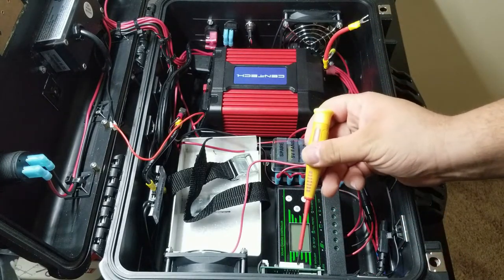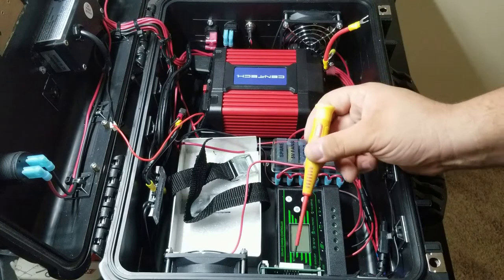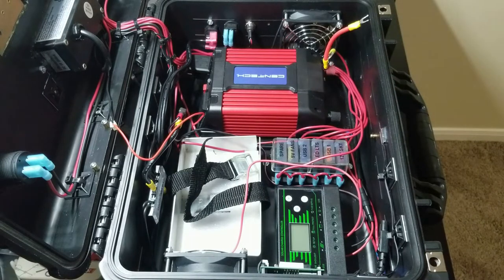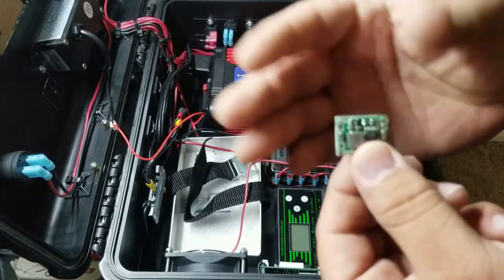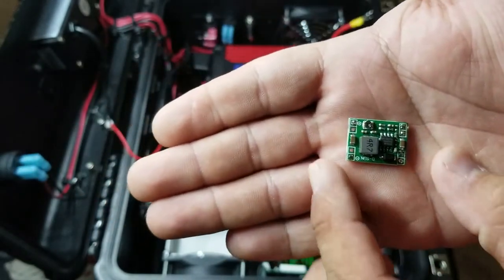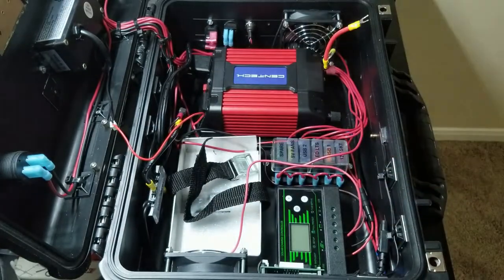However, this is designed to only accept a voltage and send it out. So it doesn't regulate any of it. And I have 12 volts coming out of the battery, but these run on 5 volts. So I went to Amazon, and I'll post a link in the description of this video. And I ended up purchasing, see if you can get a close look at it, a 5-pack of these buck converters. And what you do is bring in 12 volts, and let me see if I can show you the package here.